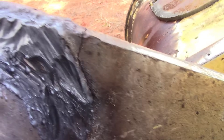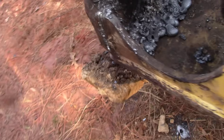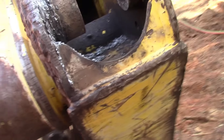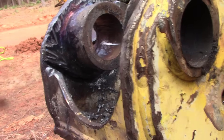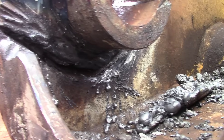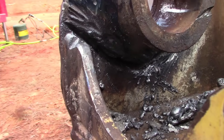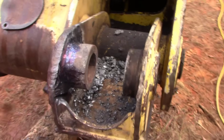Okay, we got some of it gouged off here, it's actually doing pretty good. You can see that crack really really good - it goes all the way down toward the bottom. A lot of times the heat comes up through the other side too, so I'll be sure to grind into that crack really really good. We'll do a little penetration weld all the way through it. What I've done is I've gouged out to the back plate - you can tell there's two pieces of plate here, I've cut all the way through that one and partially through that other one to get the crack out.